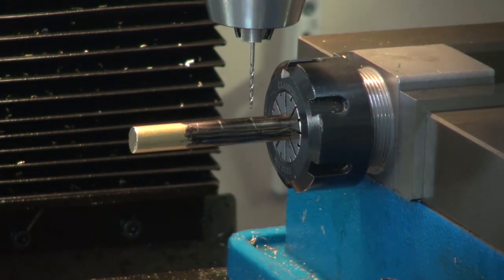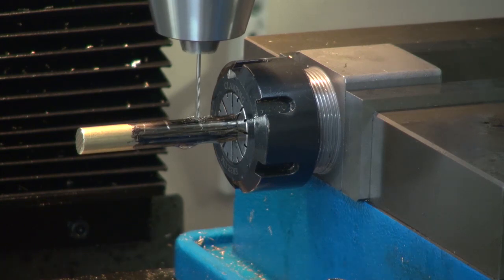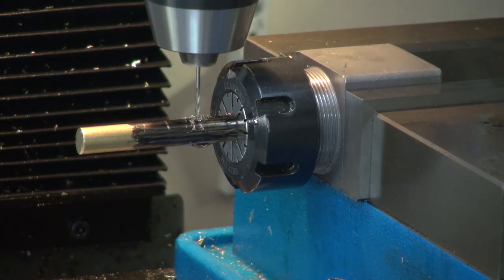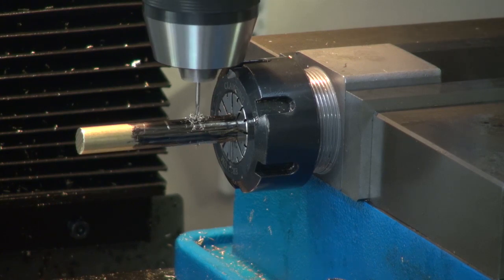So now I'm going to drill a hole straight through here. Start off slow — I've got my RPMs up to about 500, maybe 600. You don't really need lube with brass. This is machining brass — it's got a very small lead content in it which allows it to be machined very easily. And I'm through.